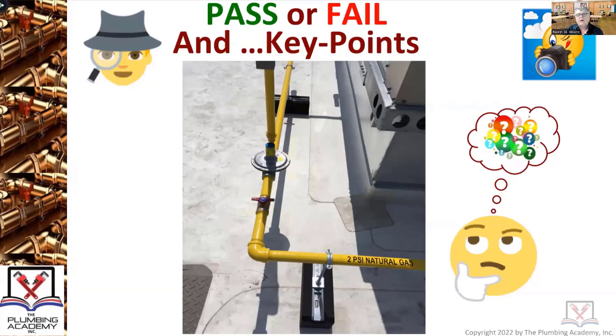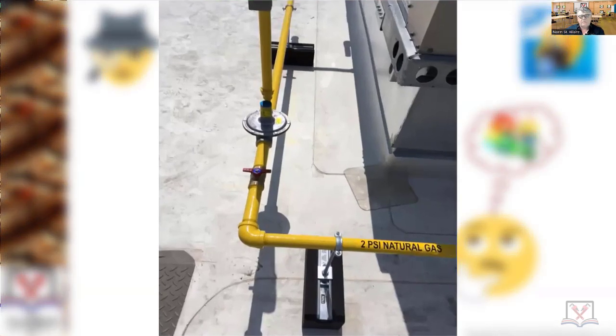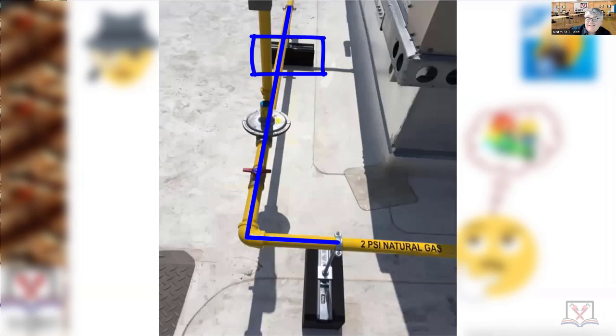Pass or fail and key points — let's say it's one-inch pipe. How far are the hangers apart for one-inch pipe? Eight feet. Very good. A lot of you have eight feet. Now here's the thing: as an inspector I'm looking at this and going, all right, there's one hanger on a super awesome hanging device, by the way, and if I took the measurement along the developed length of pipe to that super supporting hanging device, I'm pretty sure that's under eight feet, because I never cared how much it costs to install hangers when I'm doing work.